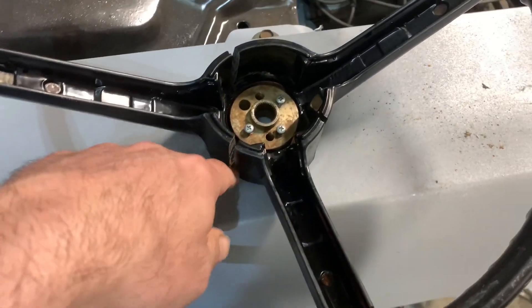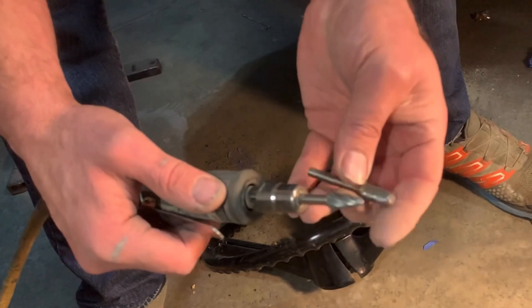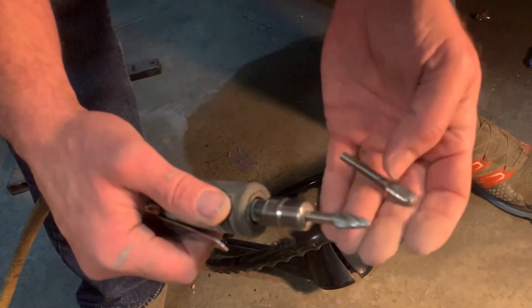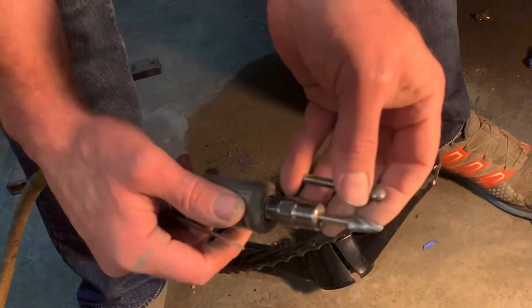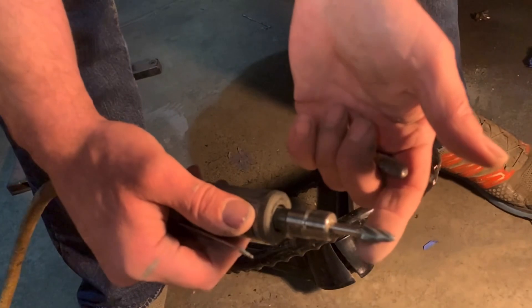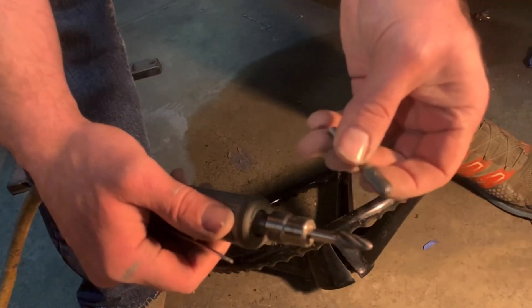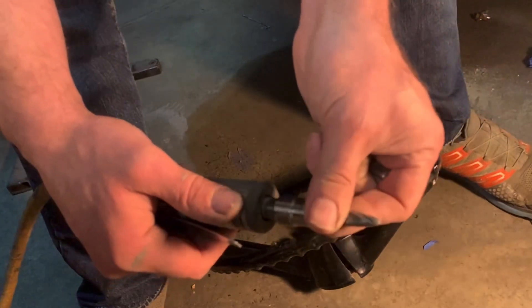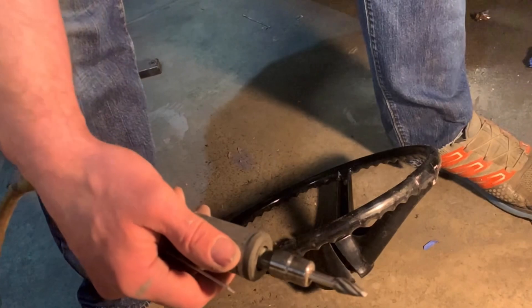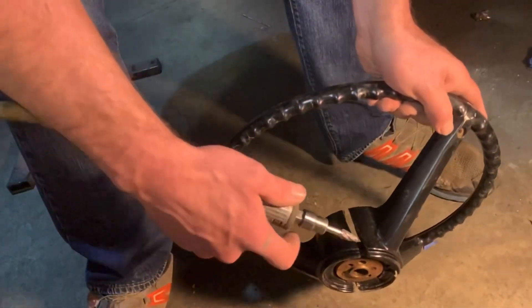Now the next thing — I'm going to get my little burr bit out. The style of burr bit: there's different kinds for different types of metal. I know this is plastic, but basically ferrous versus non-ferrous metal kind of thing. The separation of the teeth or cutting edges are much further apart here, so there's less chance of clogging it up and gumming up the works. This would probably work for plastic too. The idea is just to file back the plastic in kind of a V-groove — a place for the epoxy to go into, basically.